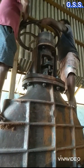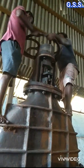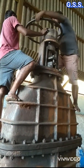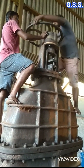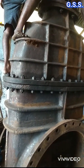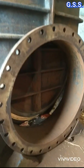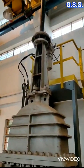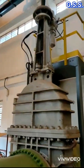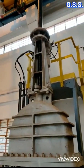Now the opening time of this type of manually operated large gate valve is about 15 minutes and closing time is also 15 minutes, which is too long. But if we go for a motorized gate valve, opening and closing time will be about one minute. This is one 44-inch, that means 1100 NB, motorized gate valve which opens fully from closed condition in about one minute.